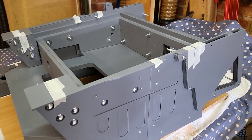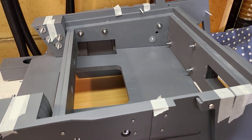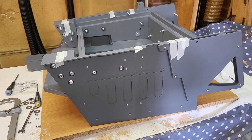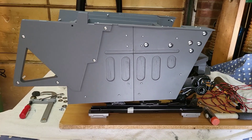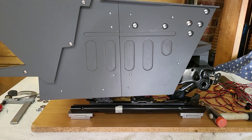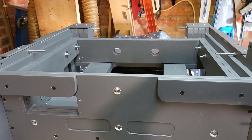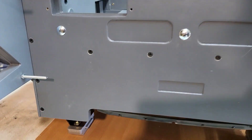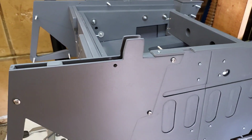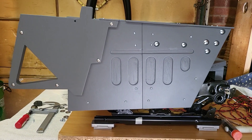At this point it's getting to the final stages of the physical construction. We can go ahead now and start to mount that onto the electronic base — this is a key moment where I'll know for sure that it definitely fits properly and will marry up together, and that in the movement of this now there's no collision in any part of the underside of the physical wooden seat on the base. Fortunately, as per the design, we can see there's free movement. I did give an allowance all the way around — effectively, below the adapter plate, the other sides represent almost a skirt that just sits and floats around the edge. Really happy that it all goes together properly.